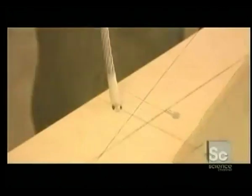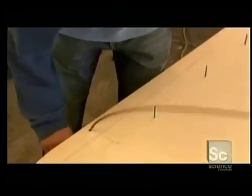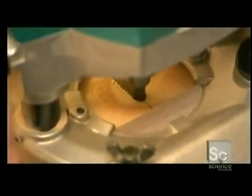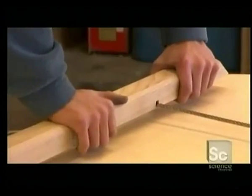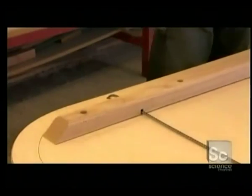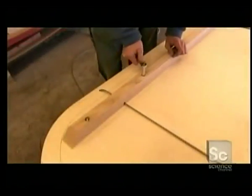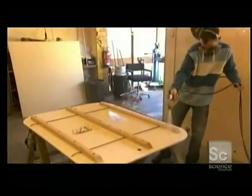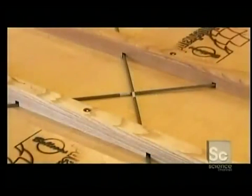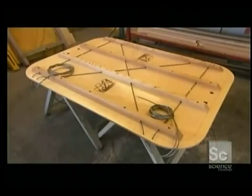After marking off the area that the basket walls will occupy, workers run the cables under the floor, which is lying upside down, leaving extra cable on both ends to come up the sides of the basket. Then they notch a groove that is the width of the cables in runners. Runners are lengths of ash wood that protect the base of the basket and give it rigidity. After bolting the runners down, workers use a branding iron to burn the company logo into the floor. A spray coat of lacquer will prevent moisture from rotting the wood. Larger baskets need diagonal reinforcement cables for extra support.